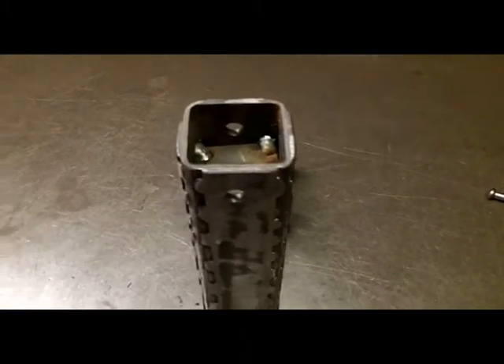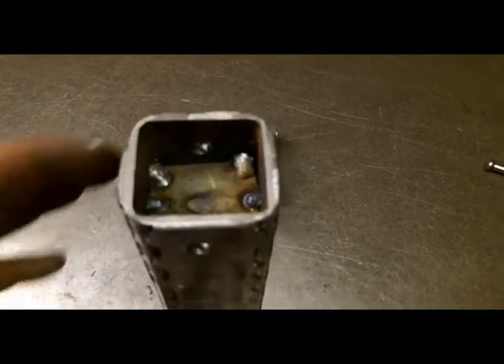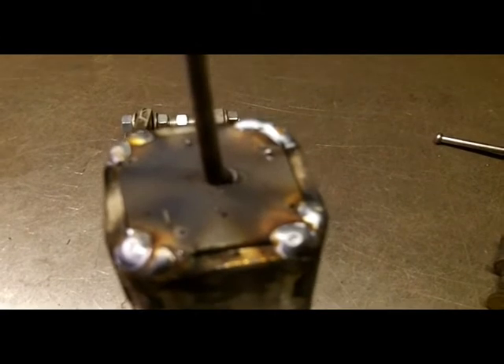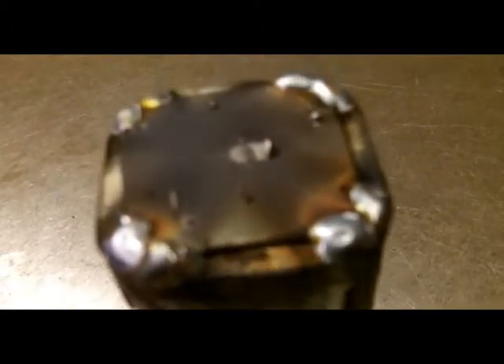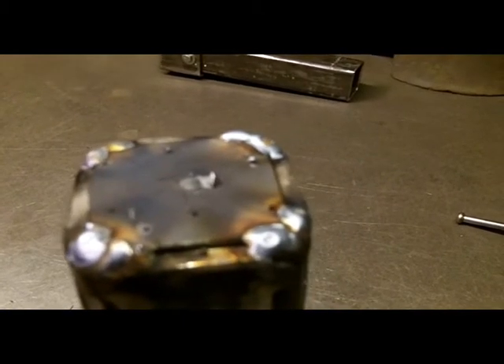Just a wee tip there: if you've ever been doing anything like that, it's worthwhile just tacking in that wee extra piece of steel in there. It's bracing it below the hole as well, but it's more likely to squish especially through time. When you bend it against itself it will break quite cleanly, so the smallest part of the tack is left and it's easy to take a wee grinder to it and clean it up. I just re-use these over and over again and eventually grind the end off.